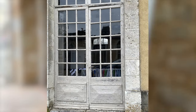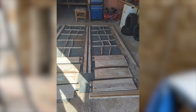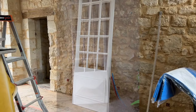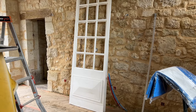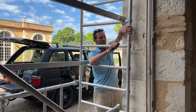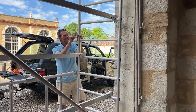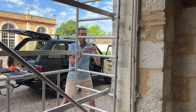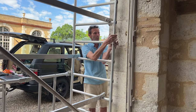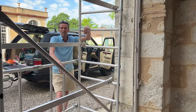When I say they were falling apart, I mean they were really droopy on one side and just not in good shape. Most people might have completely replaced them but we knew Paul is probably one of the few people who could bring them back to life. Was it hard work restoring those doors? Just time consuming, really — they had all come apart because all the joints had gone dry and all the pins had gone, so it was basically stripping right down to nothing, all the component parts, tidying up, fixing any bits that were wrong, and then putting them back together.